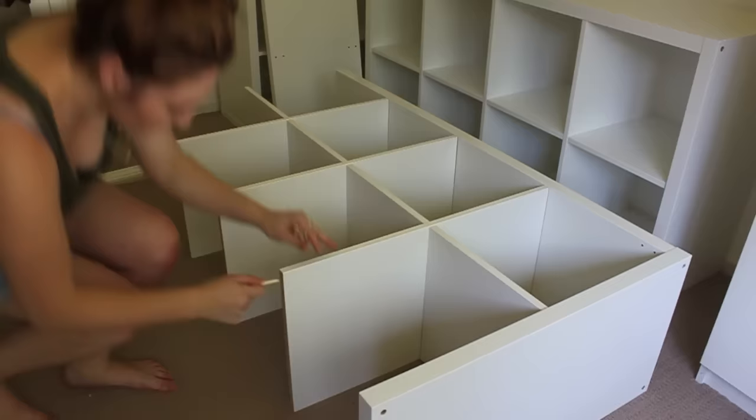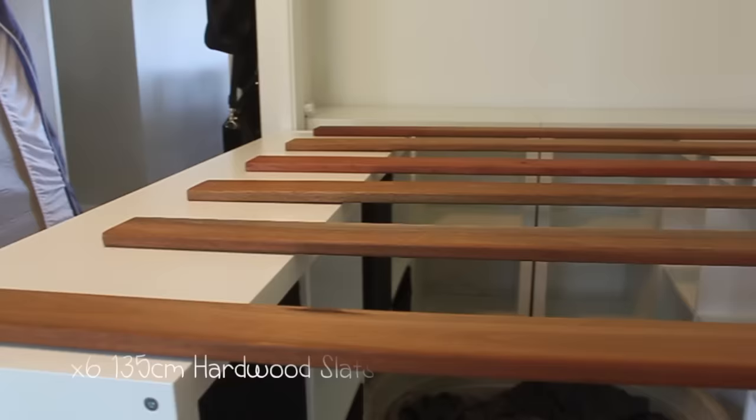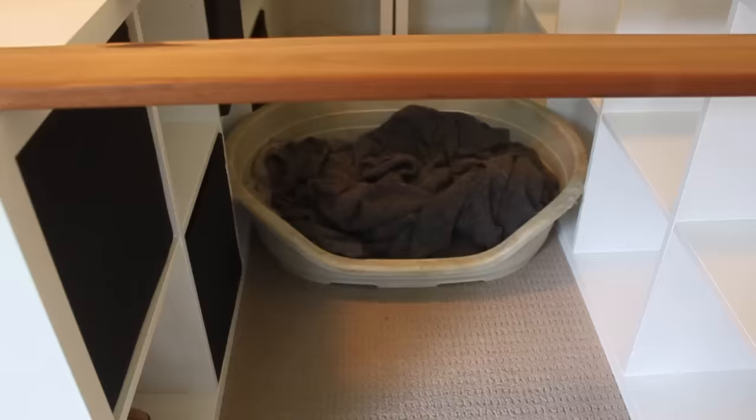The slats that I used to stable the bed are hardwood planks sourced from a local timber yard. Make sure you sand those down because splinters from hardwood are just awful. They had to be cut down to 135 centimeters to fit perfectly with my double bed. To fix the six slats to the bed frame, I first pre-drilled holes at each end of every slat and then screwed them down 17 centimeters apart.